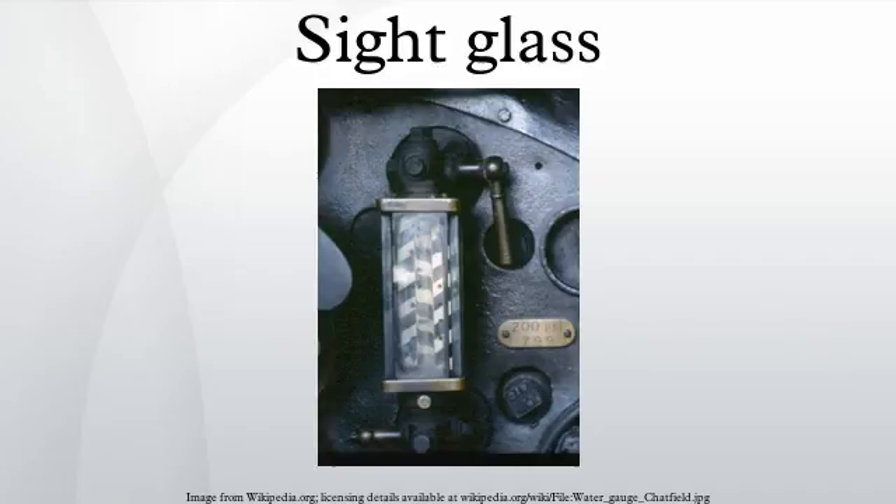Heat is applied to a glass disc and its surrounding steel ring, causing a fusion of the materials. As the steel cools, it contracts, compressing the glass and making it resistant to tension. Because glass typically breaks under tension, mechanically pre-stressed glass is unlikely to break and endanger workers. The strongest sight glasses are made with borosilicate glass, because of the greater difference in its coefficient of expansion.